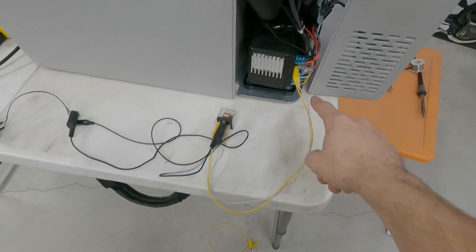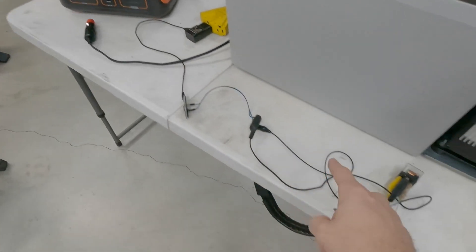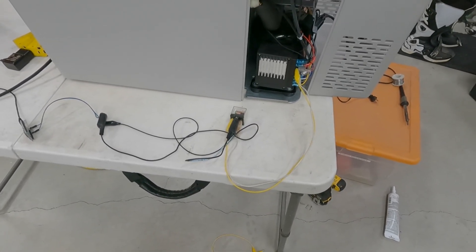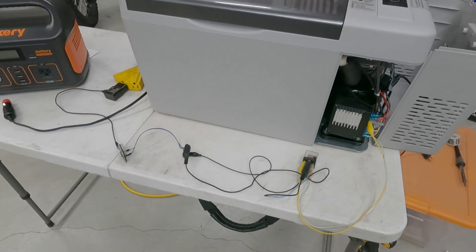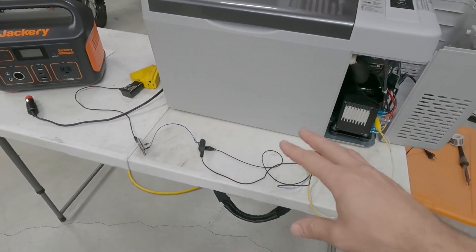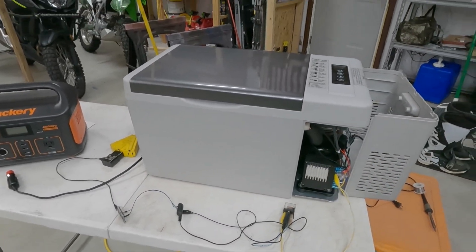What I'm logging here is I've got my little contraption, my NodeMCU, set up to log every single time the compressor starts and every single time the compressor shuts off. That logs to my SQL Server database, so I get statistics on not only how long this thing runs from on until the battery is completely dead, but also how long the compressor actually ran for.